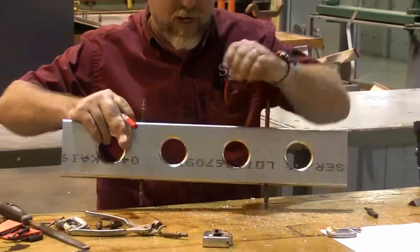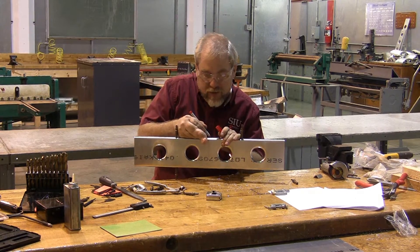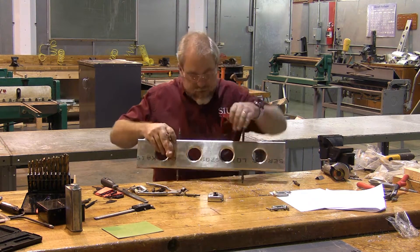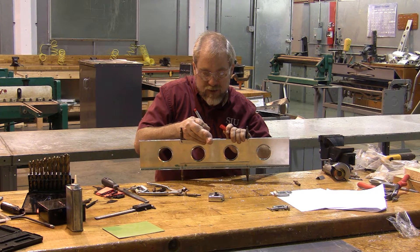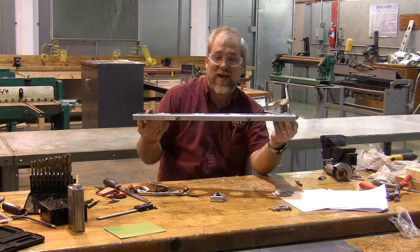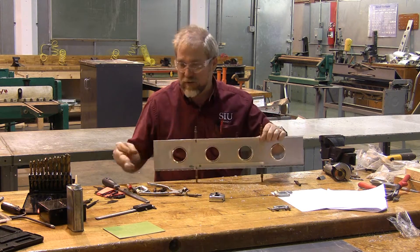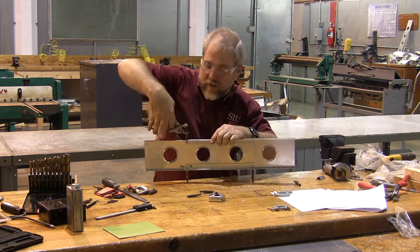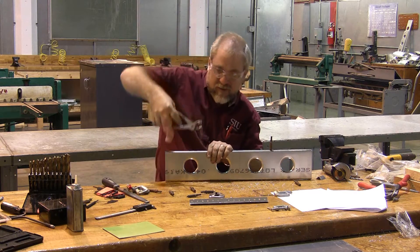So I'm going to find where my damage is, right across the center, and I'm going to mark out a three-quarter inch section right across each side. That three-quarter inch section is the material we are going to remove from our damaged spar. Now I've had a couple of students in the past go ahead and cut the spar in half with the bridge pieces still in the middle, and that defeats the whole purpose of building those pieces first. So don't forget to remove your bridge pieces, your locator pieces, before you cut the spar.